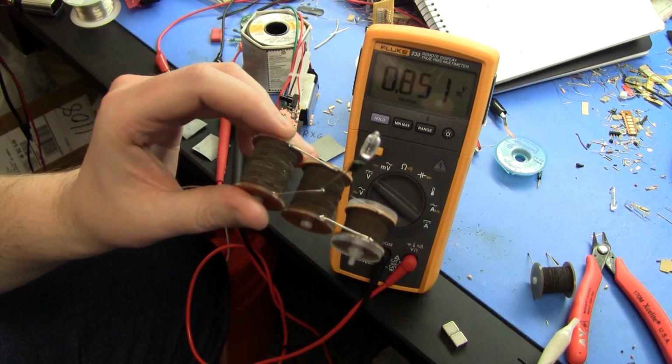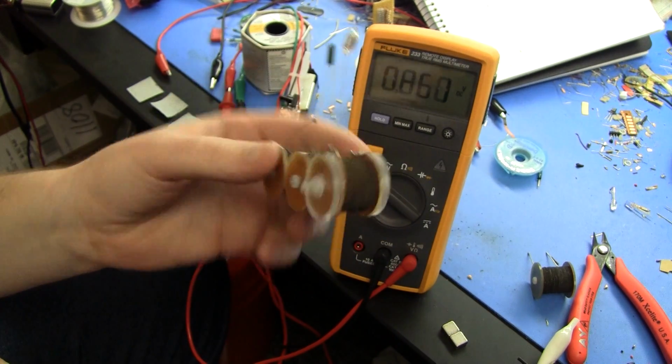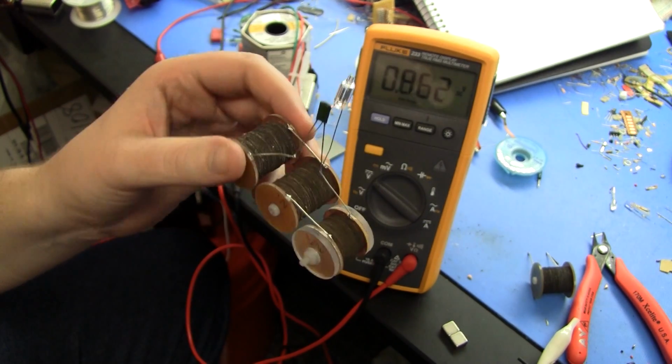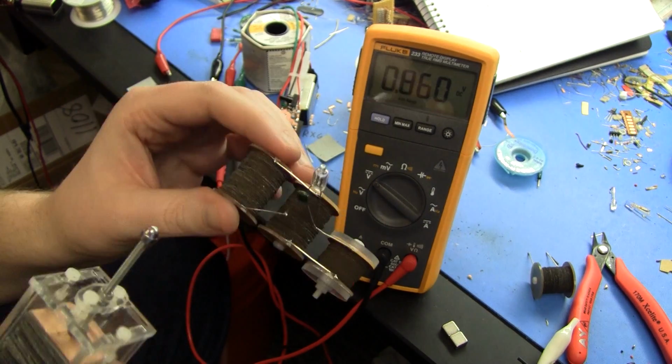This is pretty early, old technology now, and it's made with the laser cut ones, which we know have leakage and is generally a bad idea. I think if there was larger plate area, it would probably have enough current to overcome the leakage of the neon bulb. Certainly if you heat it up with a hot air blowgun, you get it up to about 60-70 degrees, it starts to blink like crazy.